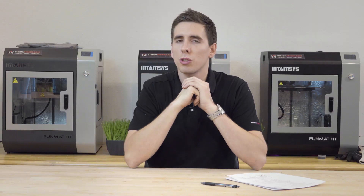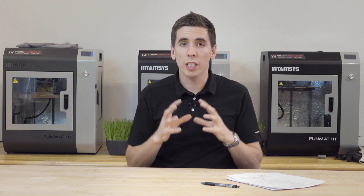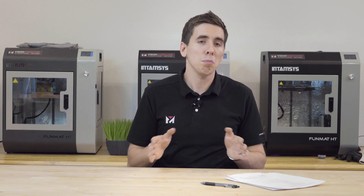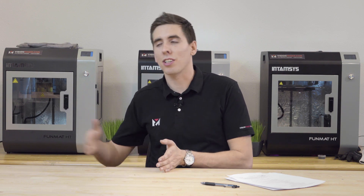We like doing a lot of stuff with resolution — playing with big nozzles and small nozzles, wide line heights and short ones. There's a lot that can be done and a lot that's not documented, so it's a really open space for new discoveries. But if you're beginning, just stick with the standard, start there, learn your way up, and then start experimenting.